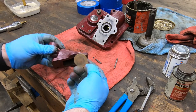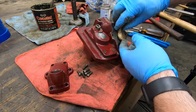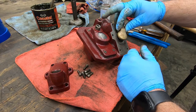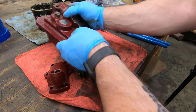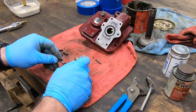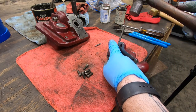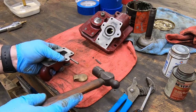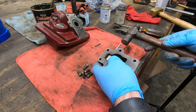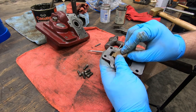Turning my attention now to the check valve and the check valve cover. During normal operation when the valves are open, this check valve will open up and allow coolant to come through the pump, up through the piping, and to the work area. When the pump is disengaged, this check valve closes and seals off the pump from any coolant still up in the pipes leading to the work area. My thought is that this keeps the coolant pump somewhat primed, but I'm not a hundred percent sure — if you know, please leave a comment.